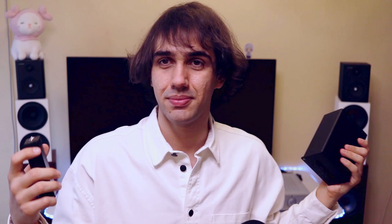When comparing the DAC Box DS with other similarly priced DACs, I picked the Earmen Traum — a very high quality DAC and headphone amplifier priced at about 250 USD, while the DAC Box DS is about 300 USD. The main differences are: the Earmen Traum is much smaller and lighter, while the DAC Box DS is heavier and larger. The DAC Box DS has no headphone output, while the Earmen Traum has two. The DAC Box DS has gold-plated RCA outputs, while the Earmen Traum has plain RCA outputs. The Earmen Traum uses USB Type-C for both signal and power, while the DAC Box DS uses an older Type-A USB cable.